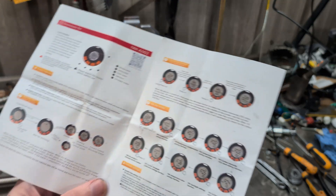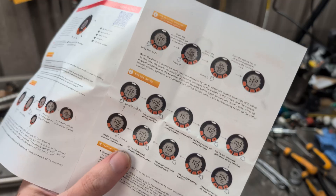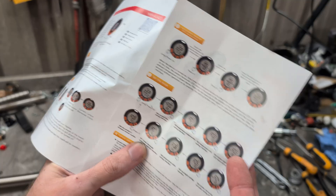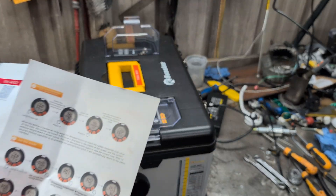From the factory I think it's set at 50 parts per million to start beeping, and 100 parts per million to turn the heater off. I think those could do with being a lot lower than that. In the settings you can adjust the carbon monoxide alarm level, and you can also do carbon monoxide calibration, which is good because they tend to drift. If you calibrate it out in fresh open air it should read zero, or as close to zero as you need.